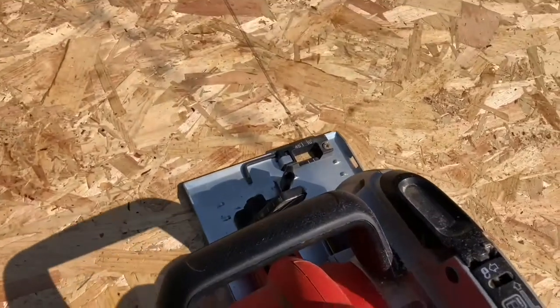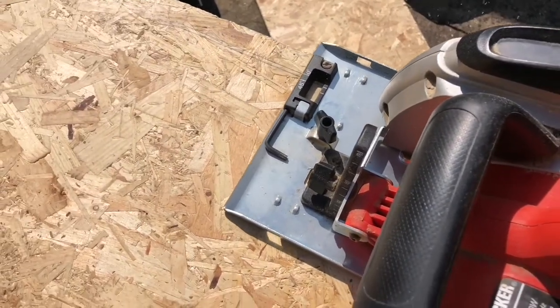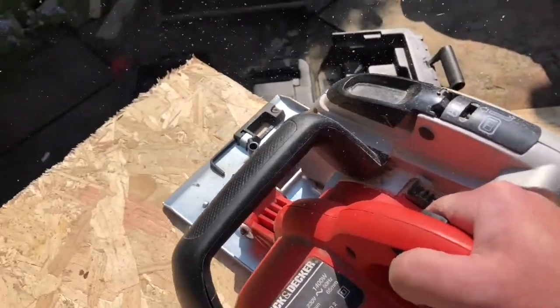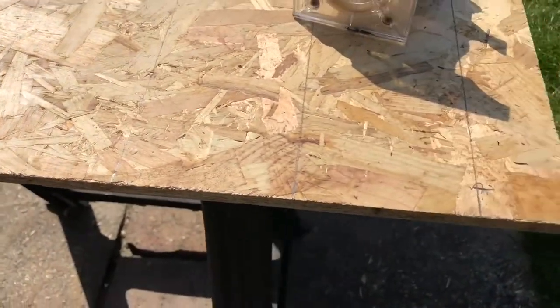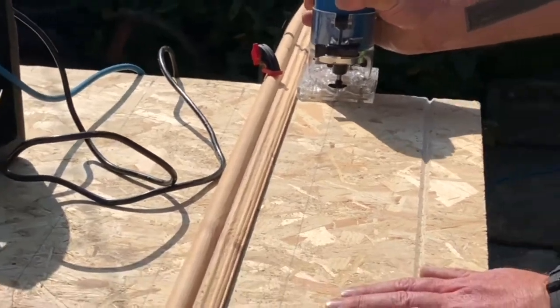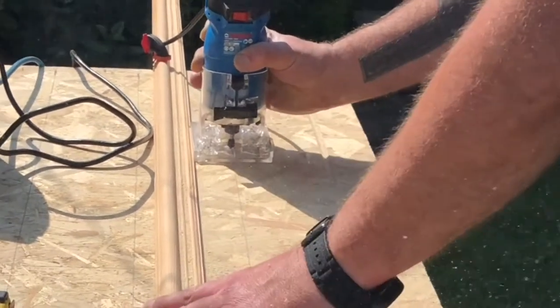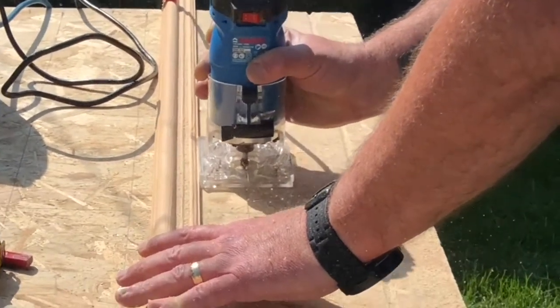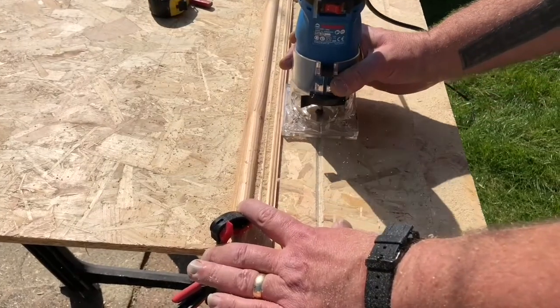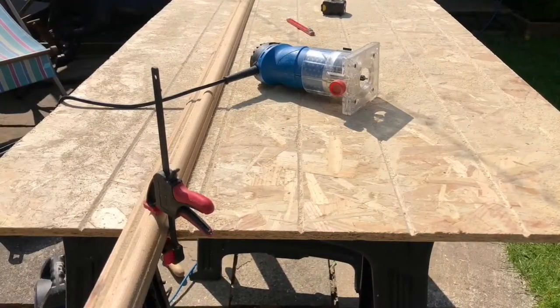So now what I'm doing is cutting out a piece for the front doors. I made the doors in one piece, and like I say, I wanted to put some grooves down there to make a tongue and groove effect. So marked it up. And then used a tapered router bit, like a V-shaped router, coming out from the end of the plate by probably around 3 or 4 mil, and then put the lines in to give it that effect. And that's one side done.